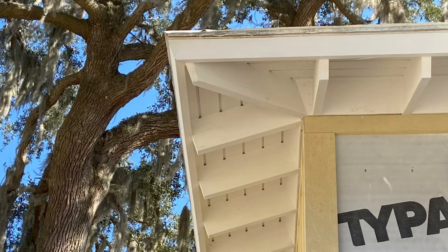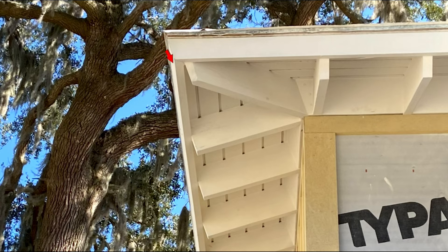This is all left exposed, so they need to look good and fit tight. If you don't know the correct angles and you're just whittling until it fits, it's going to take you a while. Because this fascia leans out of plumb, the cut on the fascia angles across here, and the miters are off of 45 degrees. The common rafter tails are square on the end, but the hip tails are not — they get an odd angle on the end.